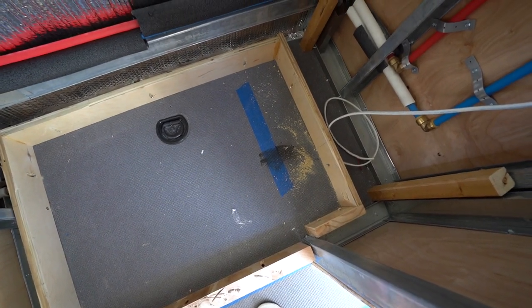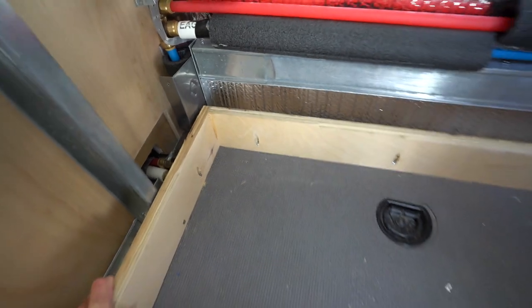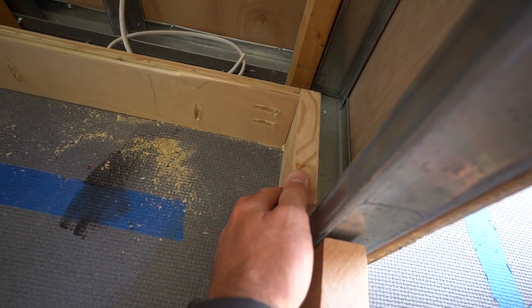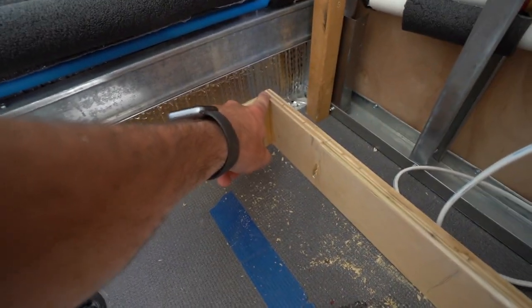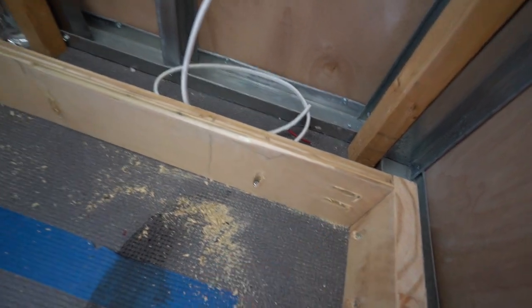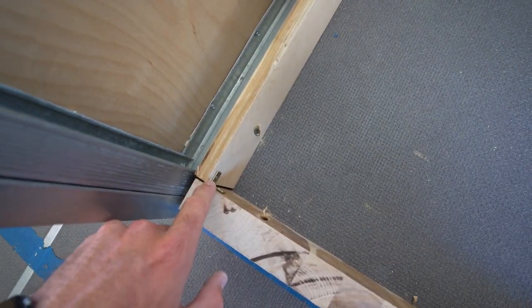In terms of the shower pan framing, I built this out of a mix of scrap wood and 3/4 inch birch — here's the leftover butcher block countertop and some leftover shelving wood. I pocket-holed it into the floor to make sure it's really secure, in addition to wood gluing and pocket-holing it together. On this side, I put a screw in from the back and used a little L-bracket.